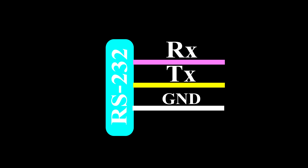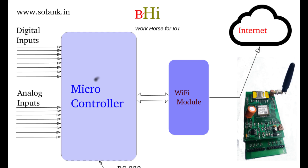This is our basic design. Apart from this, we have 8 digital outputs so that we can operate other devices depending upon the input condition. This enables edge computing — there is no need to wait for a decision from the cloud. For example, if the temperature of some liquid is exceeding a certain limit, the input power supply to the heater can be cut off locally.